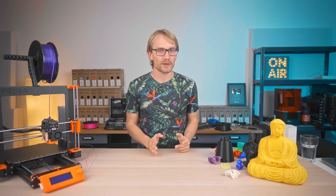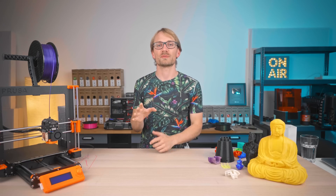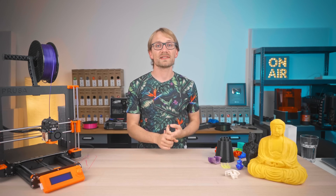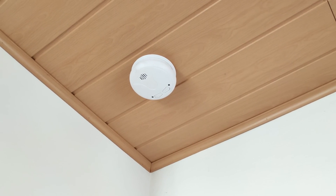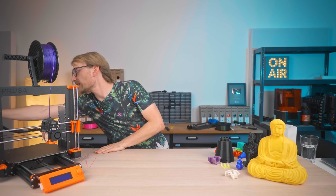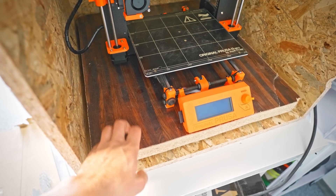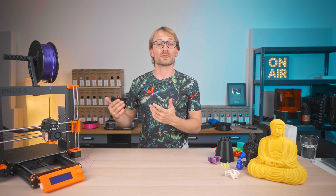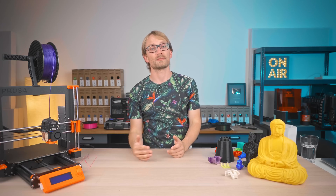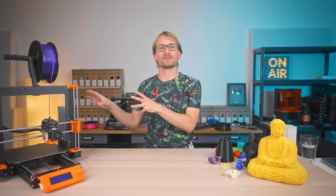That's an extremely rare occurrence, and for example on the Mk3, I know that there are checks and extra sensors in place that prevent that exact failure mode. But still, these are machines that contain relatively high-power heaters and it doesn't hurt to be safe about it. At the very least, have a smoke detector correctly mounted near your printer and make sure you can actually hear it when it goes off — you can get wireless ones that will trigger all the other alarms in the house if one goes off. Also try not to keep any highly flammable materials next to your printer — that would be dumb. If you're worried about something like this wooden box, have a look at building code and use a sheet of drywall on the inside to create a fire barrier. It also goes without saying that it's not exactly recommended to leave your printers unattended for long periods — even though I trust most of the printers I use, I wouldn't start a two-week print and then leave while I go on vacation.